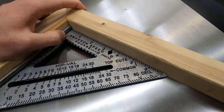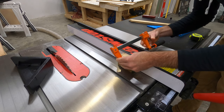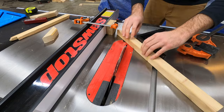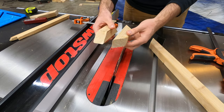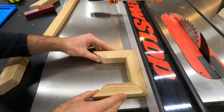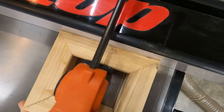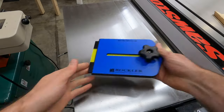Here's a closer look at that angle cut, and you can see that the square fits perfectly and this is right at 45 degrees. To use this in a practical setting like a picture frame, you'll use a stop block up against the fence, then adjust it after the first two cuts. This way you'll have two smaller pieces and two longer pieces that are the exact same size. All four angles lined up really well, so that jig works well in my opinion.